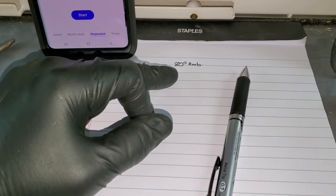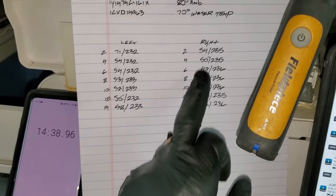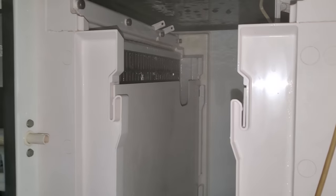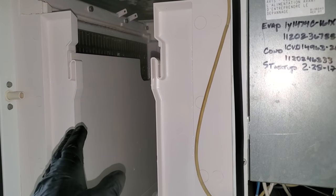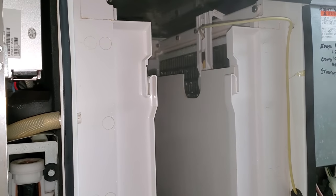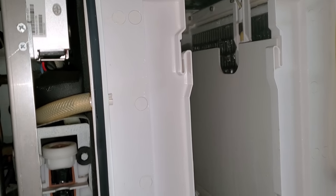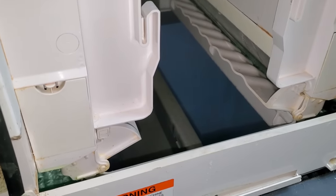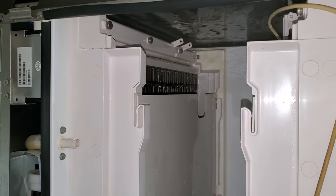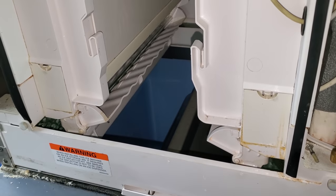My right side machine is about to make ice, but it ran out of water. Both machines made ice — this one took about 18 minutes, which is way too long. This one took about 14 minutes, which was on the hair side of being long too. I went ahead and filled them both up with ice machine cleaner and I'm running it through a wash cycle. I'm going to let it clean all the parts, then I'll pull the sensors apart because the water levels were kind of low.